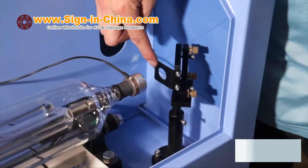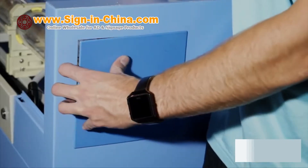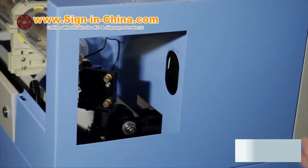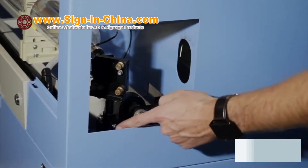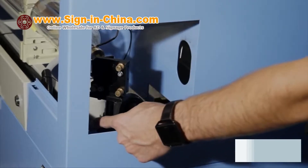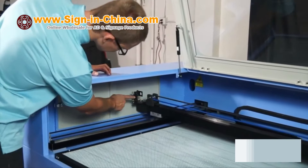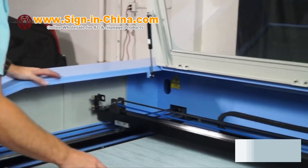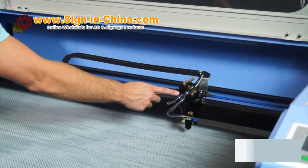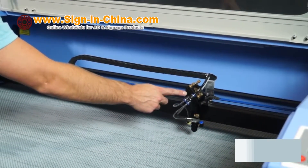On the first of three reflecting mirrors, we see a circular inlet mounted to an adjustable base that contains five separate adjustment screws. Laser must be properly calibrated prior to use. Inside the working area, we find the remaining two reflecting mirrors with the respective mirror adjustment screws. On the laser head, you will find the air exhaust lines to ensure a clean working surface environment.